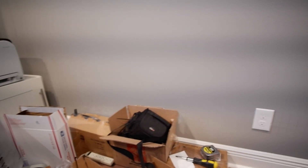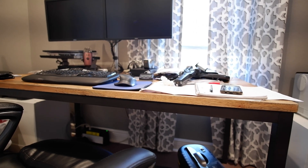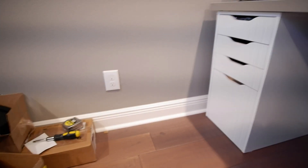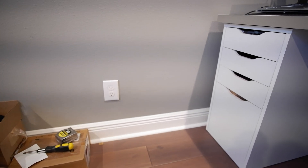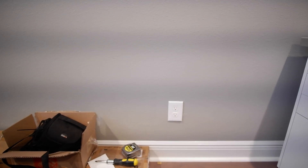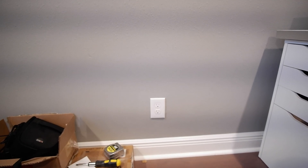Apologies for the big mess in here — I'm moving in and just unpacking everything. On this side I've got my home setup where I do video editing and personal stuff. What I want to do is put an ethernet port on this wall right here and then run it to a router or switch in this room. In a single story house this is a pretty easy job — you just go up above the ceiling, drop a wire straight down, cut a hole and pull it out. Except I'm in a two story house, so I can't get above the ceiling. The only other way is to find the nearest Cat5 run or some way to get a Cat5 run in here.